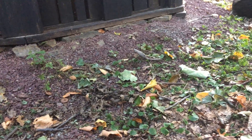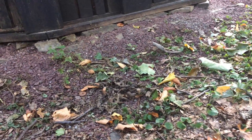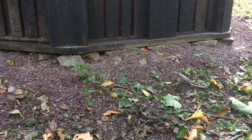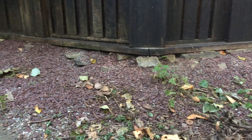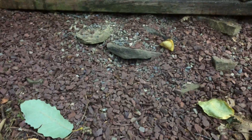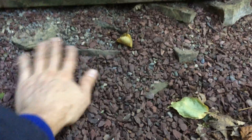After the crushed stone, I went and purchased bricks — handmade bricks, which was really cool; I can't get them anymore around here. I did a brick area on the inside that would be the interior part, and then on the perimeter I put up more stone to hold up the treated two-by-sixes. Over the years some of the crushed stone sinks in a little bit, like right here, so you just fill the hole in like this.